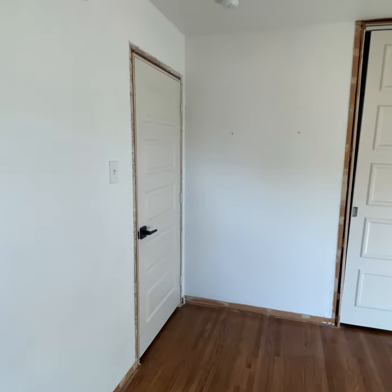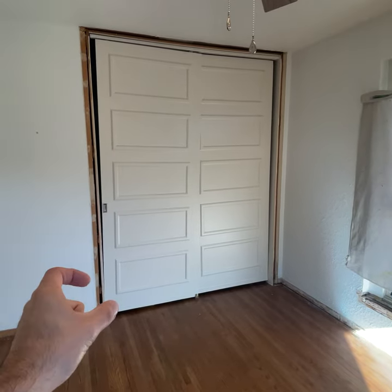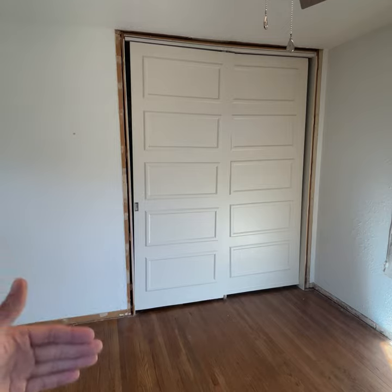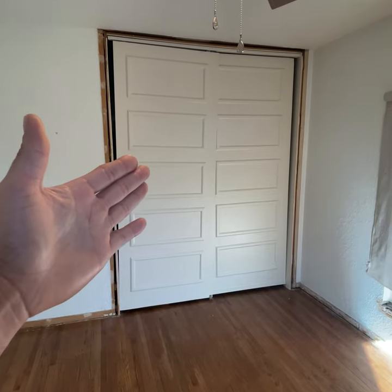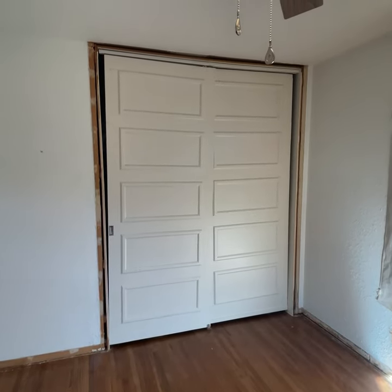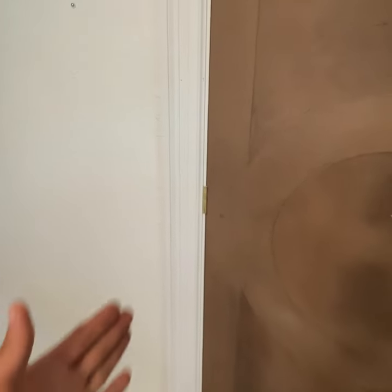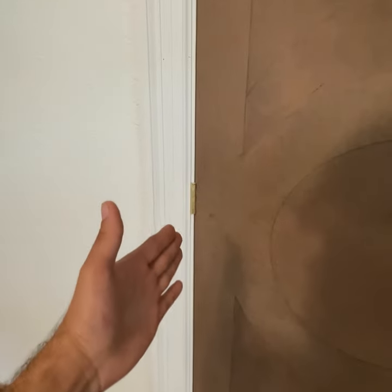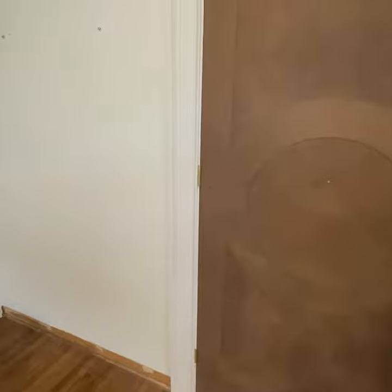With all the millwork removed, we can start doing some carpentry. We're going to start with the doors because we need them in place to install the casing — it's really hard to run baseboard without casing. These doors are going to stay but we're going to resize them shorter because we have wider casing plus crown molding going in, and we're also going to turn them into French doors. Part two will cover building the frame for these doors, including routing and attaching hinges and hardware, plus a detailed explanation on how to hang doors and fixes to common problems.